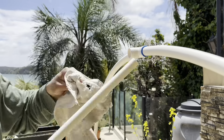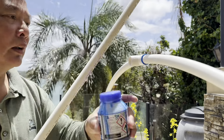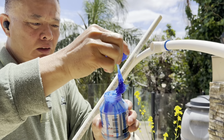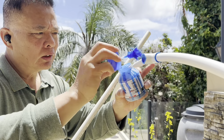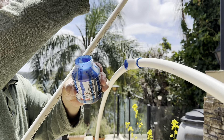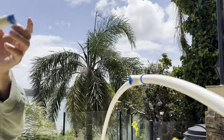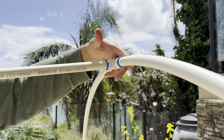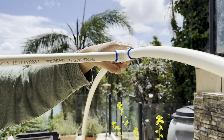Here I will do the same — clean each side of the joints to get rid of any dust before applying the PVC cement to the surface of each side. Then join them together and hold them tight for 30 seconds. After 30 seconds, they will be strong enough to hold each other.